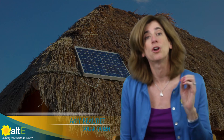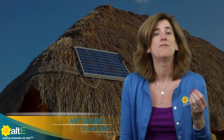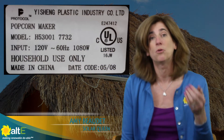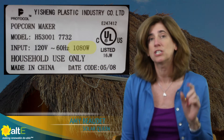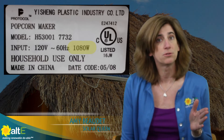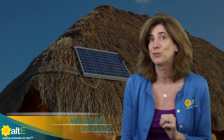So if you're doing DIY solar, you really need to know how much power you need to make, and then from there you can figure out what size battery bank, what size solar array, and all the other equipment — it will all come from this loads list. Now if you don't know how much power a specific appliance uses, look at the label on the back of it or on the bottom, and it will show you either the number of watts or the volts and amps. You multiply the volts times the amps and that will get you the watts. So figure out all the different pieces that you're going to be powering in your DIY off-grid solar system, and then let's take a look at the calculator.